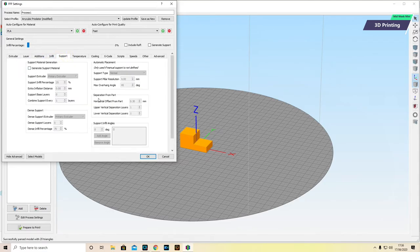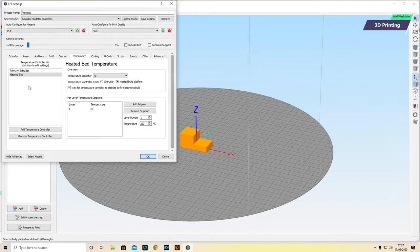I'm going to jump forward to Support. Do I need any support? Are there any overhangs? No — I don't need any scaffolding around it, so I'm not going to tick that one. Temperature — this is where most people come unstuck. For PLA, which is what I'm printing with, the recommendation is to print between 210 and 220 degrees centigrade. I've set mine to 215 because I find this particular filament prints very well at that temperature — I know that because I've tested it. You need to do the same with your prints. If I get the print too hot, it will fail; if it's too cold, it will fail. Even a new roll from the same manufacturer might need a slightly different temperature, so do a test — it's trial and error, but you'll get it right.